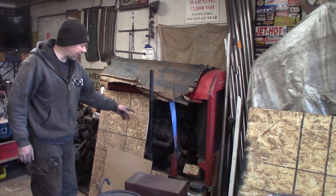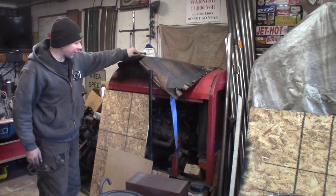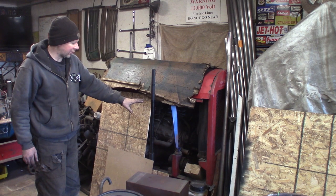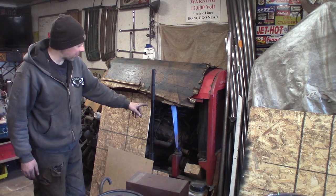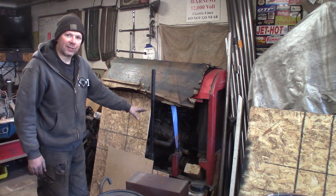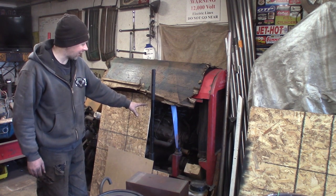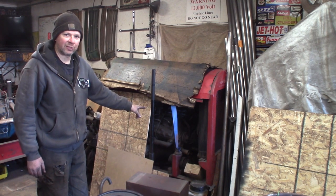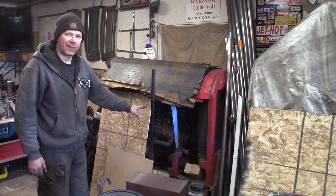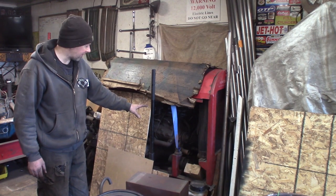The third one over here is kind of buried. This is an outdoor unit that had the full sheet metal enclosure on it. The problem with this one is the governor broke and it took out the radiator. But I'm going to clean this engine up, put new head gaskets and stuff on it, clean it all up, new water pumps. And this is the engine that's going to go in my 37 Ford. So it's an 85 horse motor, so that'll work good out in there.